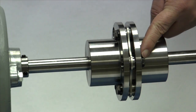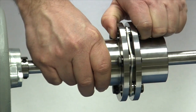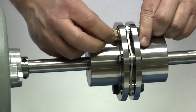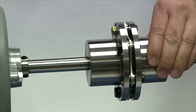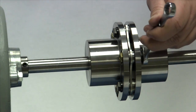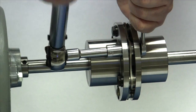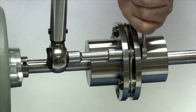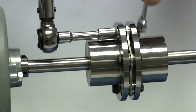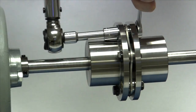Install the remaining three bolts through the small holes in the second hub, then through the bushings in the disc pack. Again, there should be a light film of grease on the bushings to allow the lock nuts to turn without twisting the bushings. Notice that the alternating bolts are connected to the opposing flanges. This is what allows for the angular and axial misalignment. Hold these bolt heads with an open-end wrench and use the torque wrench to tighten the lock nuts first to 50%, then 75%, then to the torque specified in the installation guide. If the lock nuts are not tightened to the specified torque, the bolts could work loose or, if too tight, cause damage to the disc pack. Either condition could lead to the premature failure of the coupling.